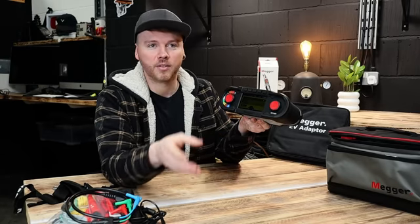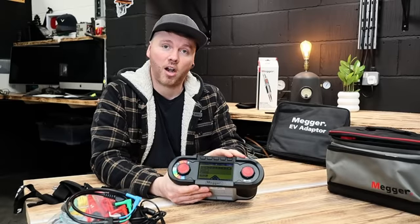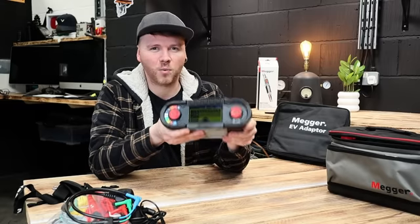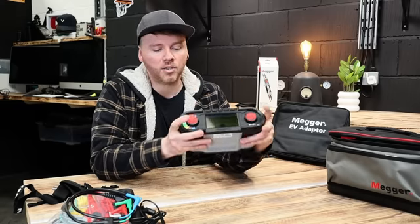Absolutely. But yeah, you can change. So these are all buttons across here, so we can change to the settings that we need. It comes preset to certain versions, you've got your 100 milliamp RCD, you click a button to change to 30, and as you turn it off, it will save what you last used. So as a domestic electrician, we really need to set this to what we need to use day in, day out, and it should fit the purpose perfectly. The two test buttons there.